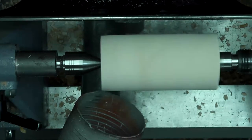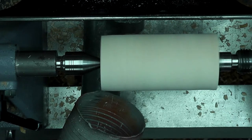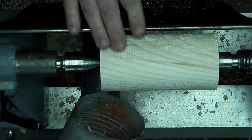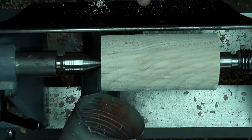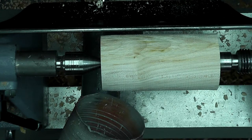There we are. I'm not overly fussed, because we're going to take this off the lathe, hold it in a chuck, take it off the lathe, basically. Every time you do that, you're going to cause an issue in terms of concentricity. So I'm not worried about roughing it down to a certain point, apart from round instead of square. This is really punky. I'm probably setting myself up here. But anyway, let's crack on.